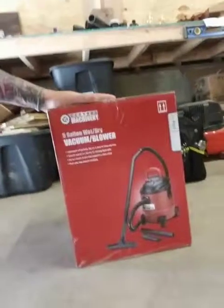And sorry, allergies are killing me. It's just what I picked up. It's a 5-gallon. If you do this, just make sure whatever you're gonna do has at least 2.5, 3 horsepower, because it is a vacuum system. So you don't want it to be too high because you don't want a vacuum lock where your steel drum crushes like a beer can. I've seen it happen.